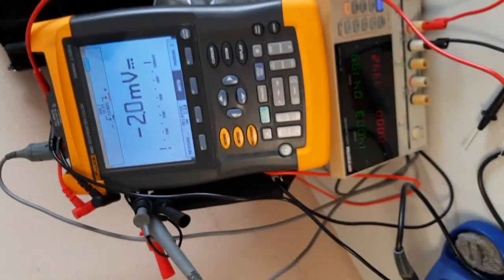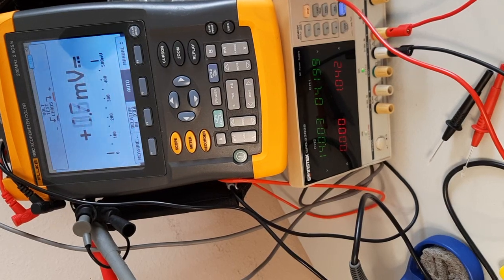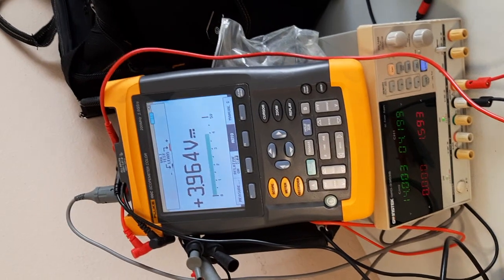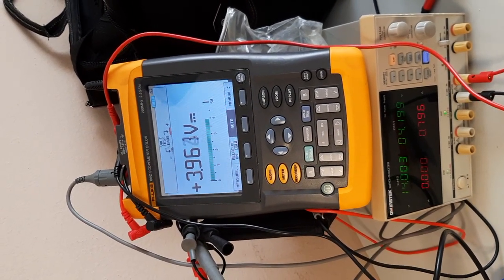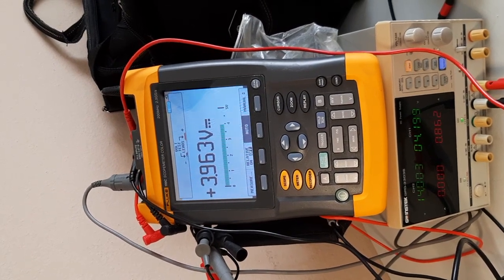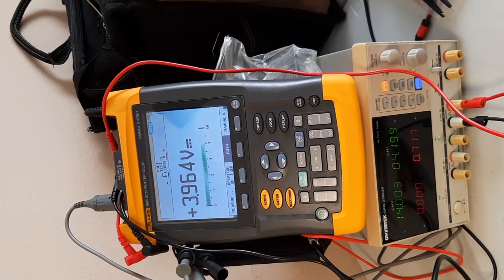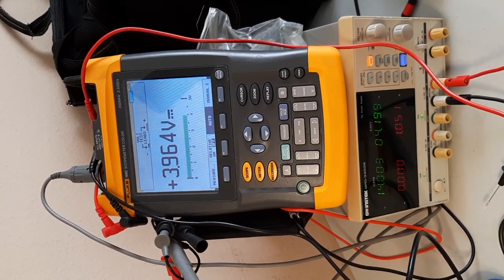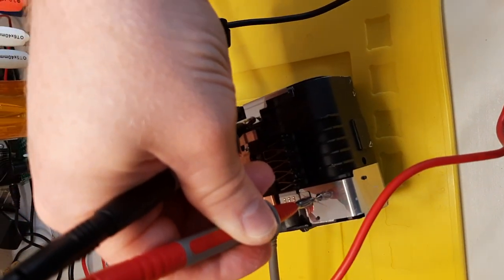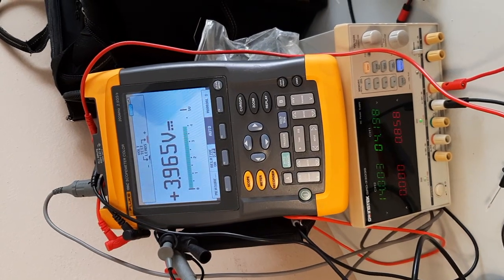That last set of three — the cells at the end are, at least in this battery, the most charged. The sets in the middle are the ones that have experienced more wear. I don't specifically know why that is. I think I have one other 12.0 battery also at 3 bars, so I'll do that one after this and find out if it's doing the same thing. The triple sets at each end point were like 3.9 to 4 volts, and the cell sets in the middle of the pack were like 3.5 to 3.6.